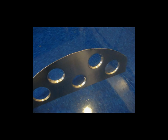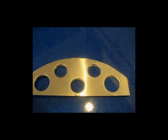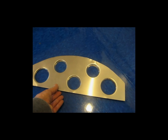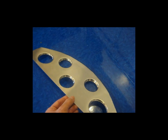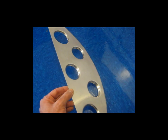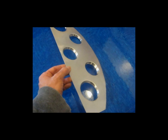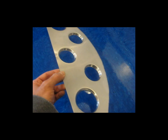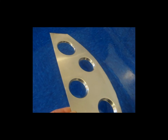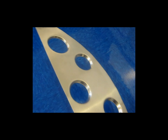Here it is so far — it's still kind of in the rough. Very, very pleased with the flanges. They're nice and deep. My first few attempts with making the dies the flanges were very thin, but these are pretty deep. I think they're deep enough but not too deep, and I think they look good for the size of the part.